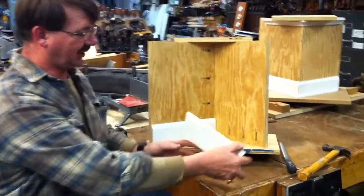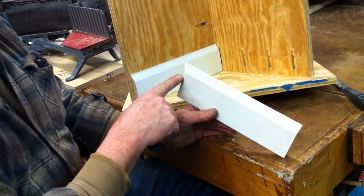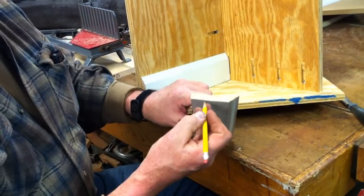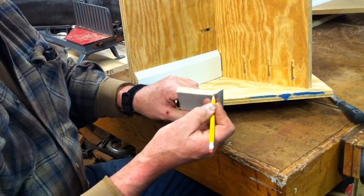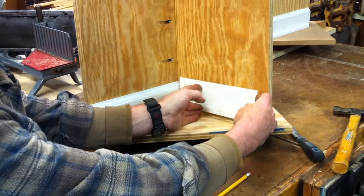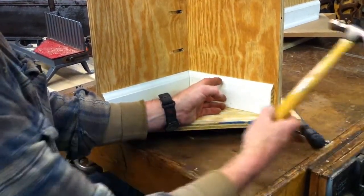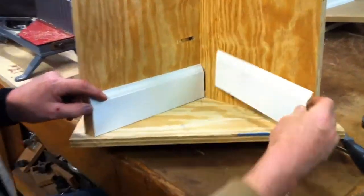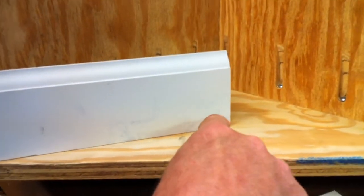What we do here is cut a 45 on this piece of wood, then use a coping saw to trace the outside. But when it comes time to the fit, we're going to take a pencil and make a very small deposit of graphite here, then tap it in just to give the impression of where we have to take a little tolerance out.